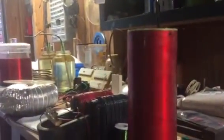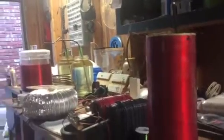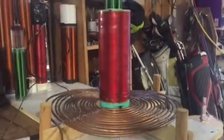Not on this video, but we're going to take this matching coil, the sister coil, to that one. Same turns, same amount of wire, and then we're going to hook that up to an air capacitor and to an LED. And when we fire this up, we're going to go out walking around and light up the LED. And I'll show you guys how we do that, what we use, what kind of diodes we use, and the whole process.